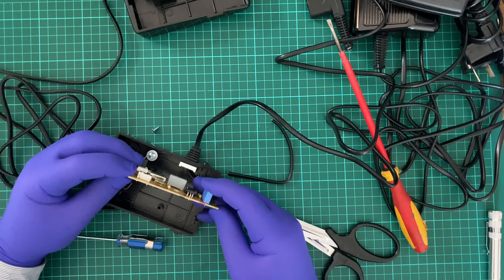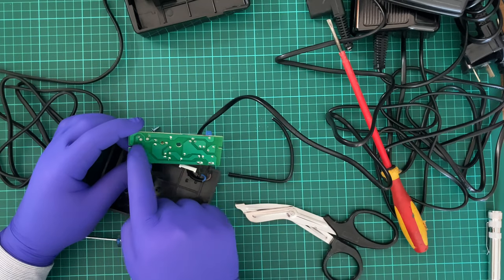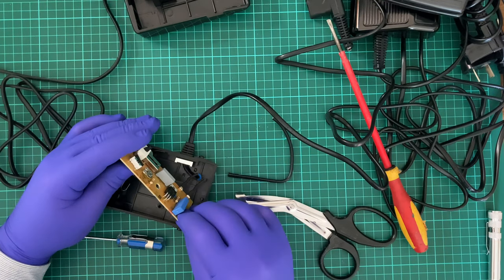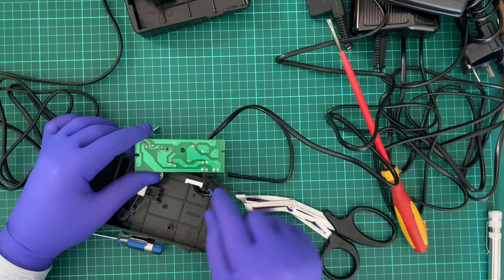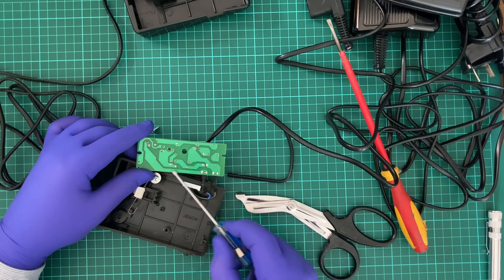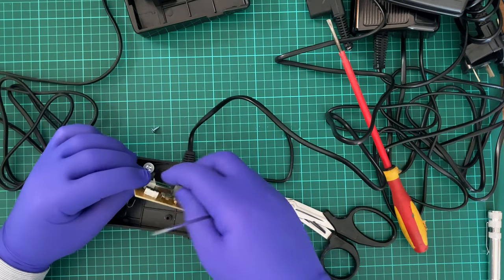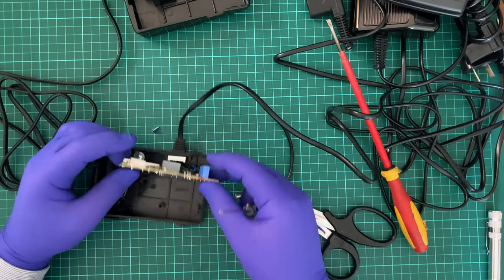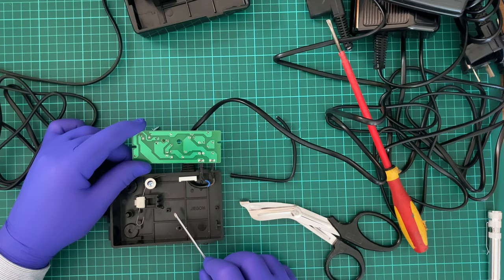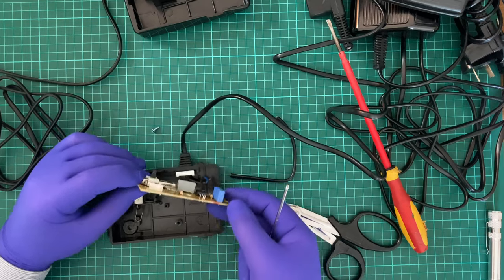So let's take a quick look. The two pins for this switch, one is here, which directly connects to the blue wire, and then the other one connects to the other side. So cable comes in here, the voltage will travel, power should travel either through this way or through this way. But here's where the circuit's basically cut, is this switch. So from what I can tell, this switch will physically disconnect the mains from the sewing machine. So there's no phantom power running through as long as this switch is properly disconnected. That's very good.